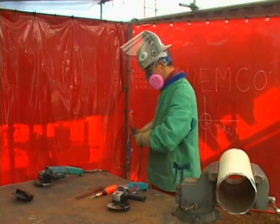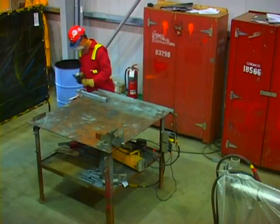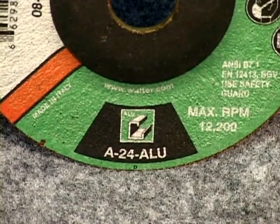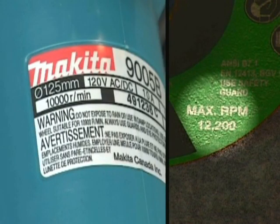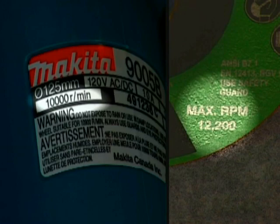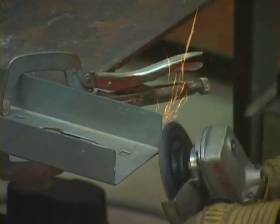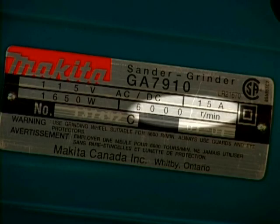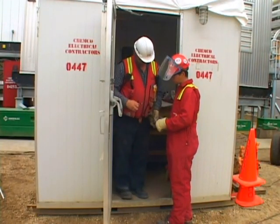After changing a disc or when first beginning work with a grinder, test run it in a safe position using both hands. You're checking for vibration or wobbling that could indicate poor installation of the disc or a poorly balanced wheel or disc. All grinders and discs have RPM ratings. The grinding disc must always have an RPM rating at least as high as the rating for the grinder — the disc may have a higher rating but never lower. Discs rotating at higher speeds than the rating may fly apart or shatter. Double check that both RPM ratings match. Your grinder RPM rating needs to be legible on the tool, but if in doubt, check with your supervisor or at the tool crib. Always ask.